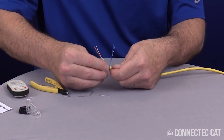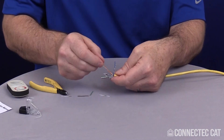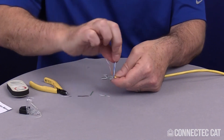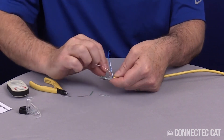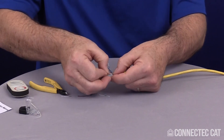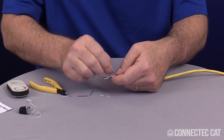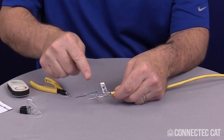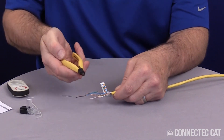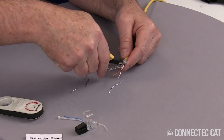Tuck it down as far as it will go. You might have to twist it a little bit to allow for the other conductors to actually sit in place. Get your pairs of the other conductors in the right location and then lay these into those upper slots — it will hold the wires so you can get them lined up and secure them. Once you have those in place, go ahead and trim off your extra conductors using the flush side of the diagonal cutters, trimming each one right level at the top of the conductor.